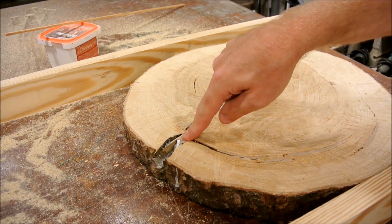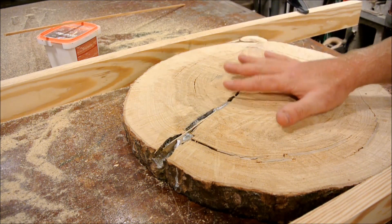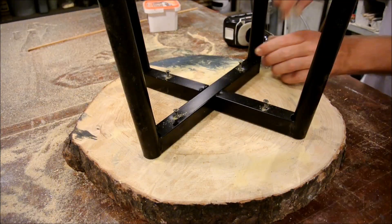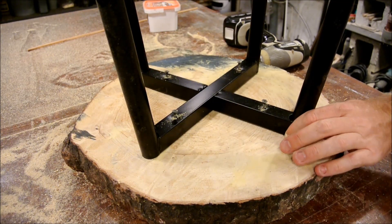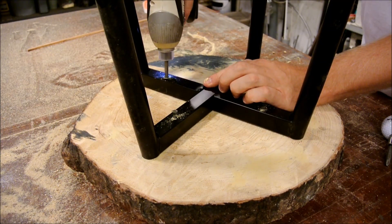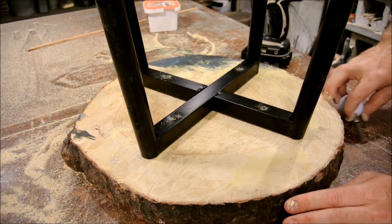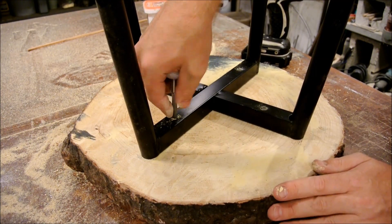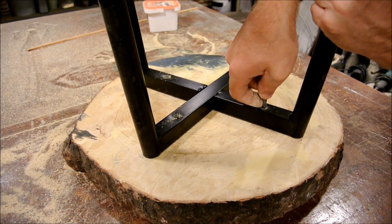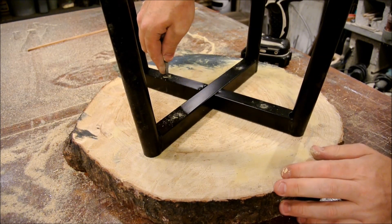In case you're wondering, this is just glue and fillers and glued wedges — I never wanted to drive this larger. And this log is very old and very dry, but I never put any metal objects in it because I had always known I was going to do this. Projects like this are often long term and can't be finished in an afternoon, and for that reason a lot of this crap takes a lot of patience. So I spread wood filler on the underside, and someday I will probably take it back off and finish the underside with polyurethane. I think I'm going to finish the top with polyurethane too. I'm going to leave it pretty rough, but I want it to be moisture-proof, and now that it's done curing, I want to get it to a place where it never splits anymore.